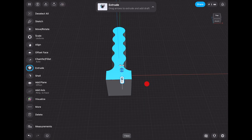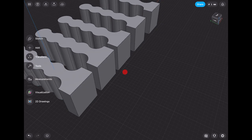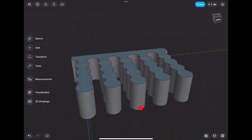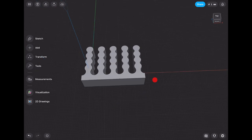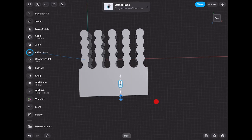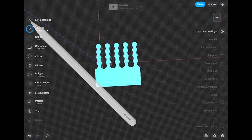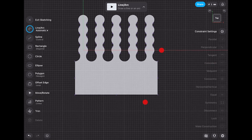Since this appears to be correct, I'll clone this out multiple times. After I have multiple copies, I can connect them using the alignment tool, connect them all together, and then perform a union to make them a single solid object. I'll clone this off again to save for later. Coming back to the original, I can modify this as a 3D object — I'll extrude out the bottom to give me a little more room. I know the profile radius of my C8 SCT is 114 millimeters, so I'm going to add an arc to the bottom with a 114mm radius so it mounts flush to my telescope on the outside edge.